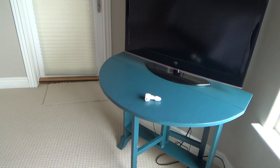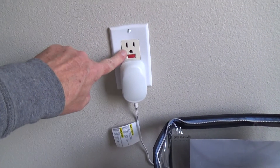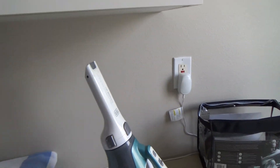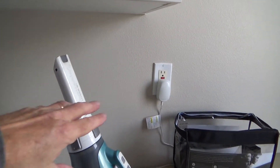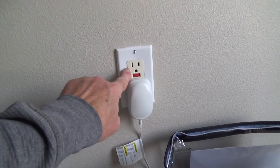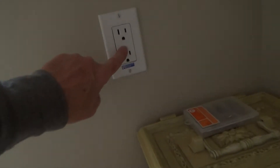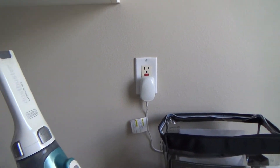Well, that's all I got for this one, and I'm glad I checked that out. I'll put that back — now I can mark that off my list. I'm still amazed that in this laundry room, this GFI is controlling all of the outlets, at least the ones with the brown plugs. All of those outside on the decks are connected to here. I'm still surprised about that. Anyways, at least I got it figured out. Here's another outlet — see, it says 'GFCI Protected Outlet.' They should have had these little decals attached to all the electrical outlets outside, and then I would have known for sure.